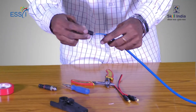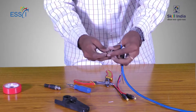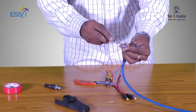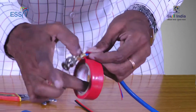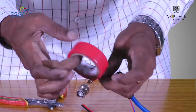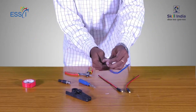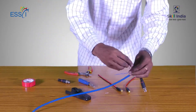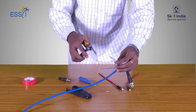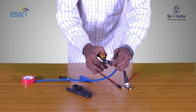The Core is connected to the BNC, and the Shield is wrapped at the Terminal of the BNC. We cover the Terminal with Insulation Tape for safety. This is how a BNC is connected, and it is used for transfer of video. The other Sub Cables are used for power.